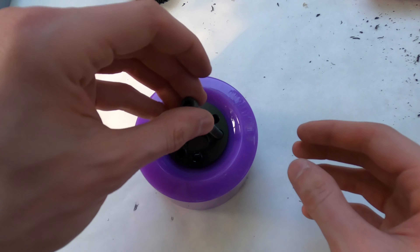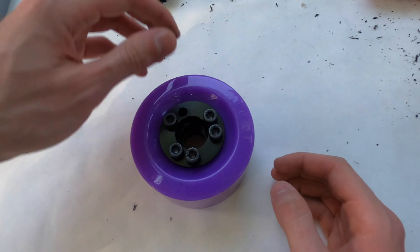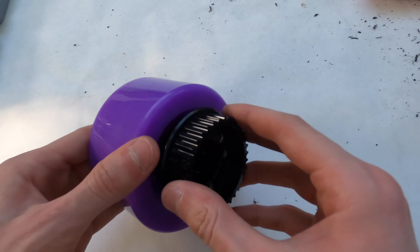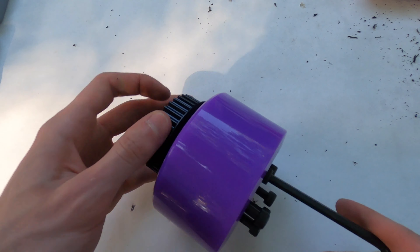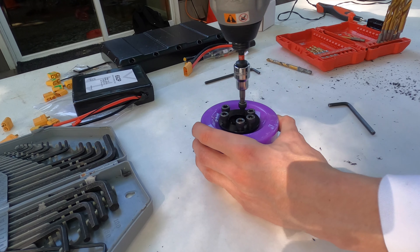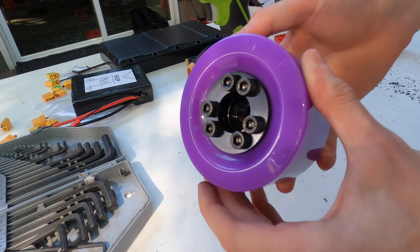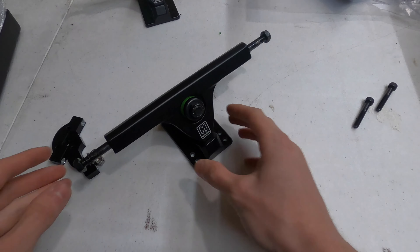The first thing you want to do is align this outer retaining ring with the pegs and then slide all of the bolts through those holes that you just made with the drill. You'll then be able to align all of the screws with the screws on the actual pulley itself, and then screw all of those long screws through the spokes and into the threads on the pulley. Using a drill or driver with the proper hex bit will be very helpful for this process. Since the screws are long, make sure to top it off with a hand allen key wrench, and your wheel pulley is bolted to your wheel.